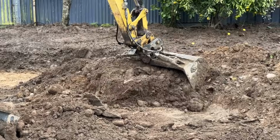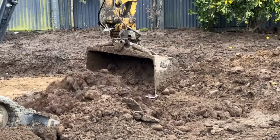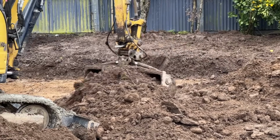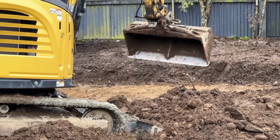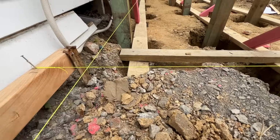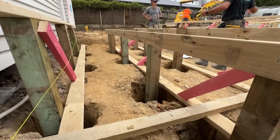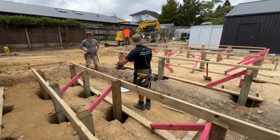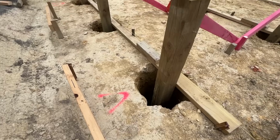Next thing we do is excavation and getting rid of all of that excess dirt, moving it around, filling up some areas, cutting out some other areas. So once we'd established an acceptable finished ground level, we could then mark out the four corners of the building. We can then use our set out string lines to mark out where all the piles are going. We have to get a digger driver back and he drilled down into good ground. From memory here is about 2 meters.